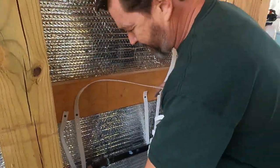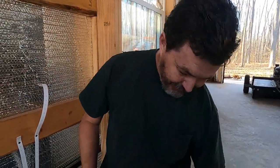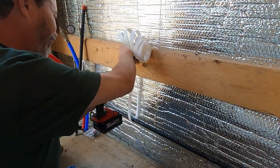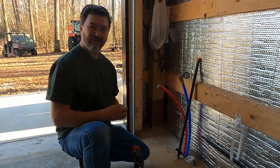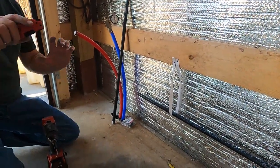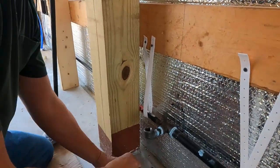So I'm just trying to line this pipe up with this pipe so that it'll be supported when I go to dope it and screw it in. Let's do the same thing on the other side. All right, we are hitting the mark. Right at the moment, I'm about 2 inches from this mark, but once I get tied in and slide things down a little bit, I think we'll be a little closer. This is what I was shooting for, but we're just kind of roughing it at the moment. Time to dope up a half incher.